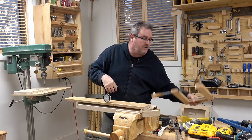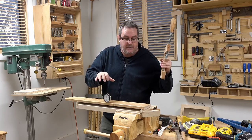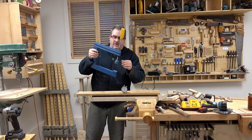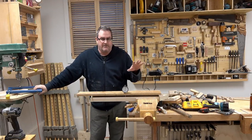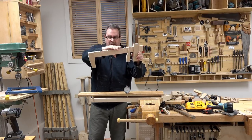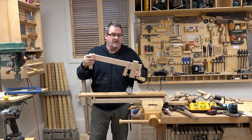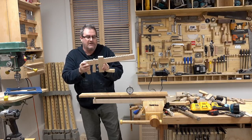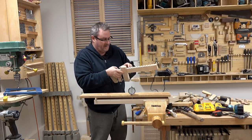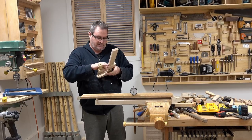I made this one, basically finished it yesterday, and gave it a try on this test rig — the very same setup that Matthias and I used when he was here, so the results would match up. The major problem with my red clamps is that they break because the notches are on the pull side. There are two forces at work in a clamp: compression on the outside and tension on the inside. You really don't want any breaks in the material on the tension side, as it'll be more likely to rip apart. So I made this clamp after the red ones, which solves that problem.